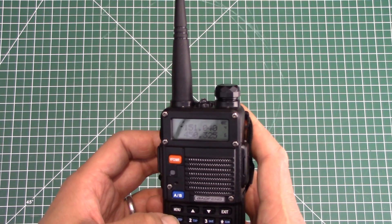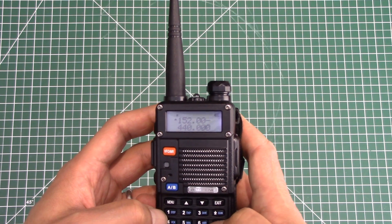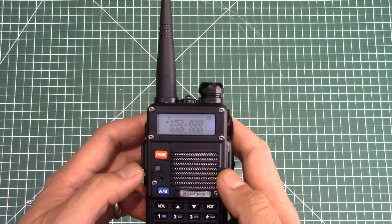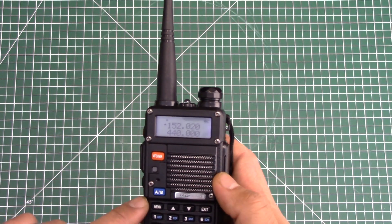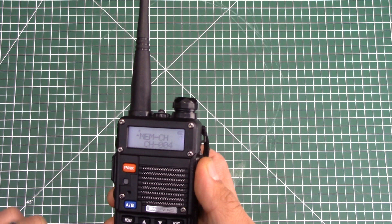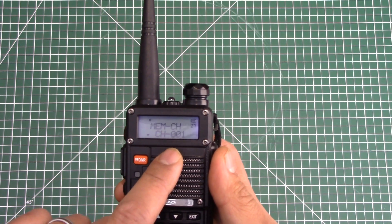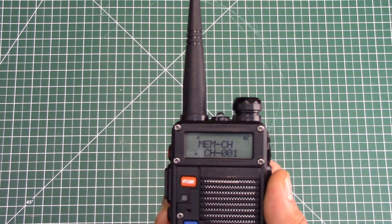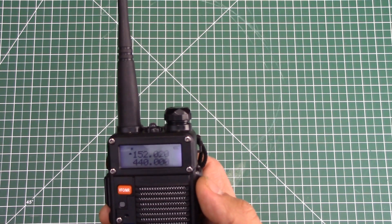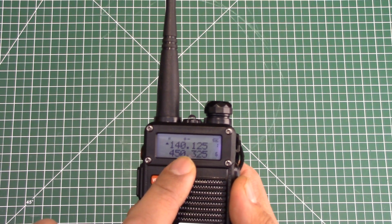So I'll go to another frequency. Let's switch over to frequency mode and punch in 152.020. Let me show you that it's going to choke if you try to put this into an existing slot. Let's do our same procedure — hit menu, go to option 27, hit menu again to start selecting channels. Let's say I want to put this in slot number one. If I go down to slot one, notice it's got the CH prefix, so something's already here. If I push menu, I'm not going to get that 'receiving into memory' message — instead it says something about 'transmitting memory,' which basically means it didn't get stored. If I come back and go to channel mode and go down to channel one, that is not the 152.020 number — so it didn't work.